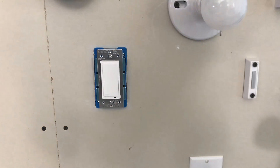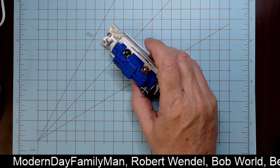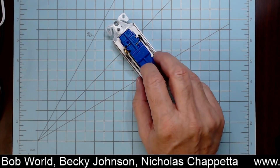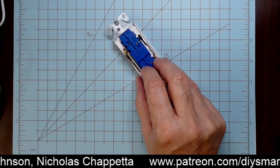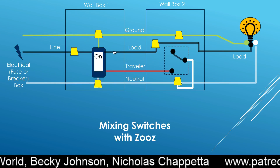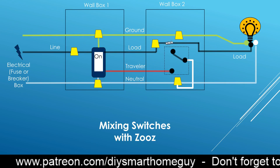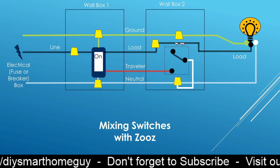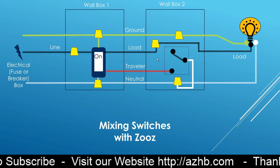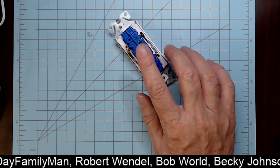The smart switch is installed and loosely set in the box. For the secondary three-way switch, place the white wire against the black common terminal lug. Then take the red wire and put it on one of the bronze terminals — it can go on either bronze terminal, it doesn't matter. The black wire that's paired with the red wire gets a wire nut connecting it to the other black wire — you're completely bypassing that black wire around the switch. No black wire goes on this three-way switch.